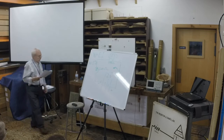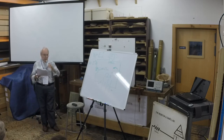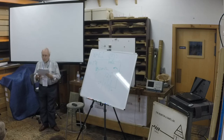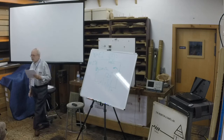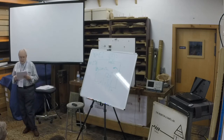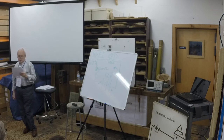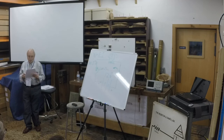In the earliest days of electric action, current was supplied by batteries and later by generators. 8 or 9 volts was enough for those early electromagnets, and you might need a whopping 10 amps for a really big organ. Feed and ground wires didn't need to be very large at all. Connecting ground wires under washers with wood screws usually didn't give much trouble, as the magnets could tolerate a drop of several volts and still work. But these days things are a bit different.